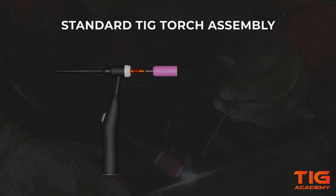The gas cup is screwed onto the collet body and placed around the tungsten electrode. Now you can set the protrusion of the tungsten — you can loosen the back cap a little if needed. The protrusion of the tungsten should be no greater than the diameter of the gas cup orifice in order to provide adequate gas coverage. Here it's about half the diameter of the gas cup orifice. Once the protrusion is set, you can fully tighten the back cap and the torch is ready to use.